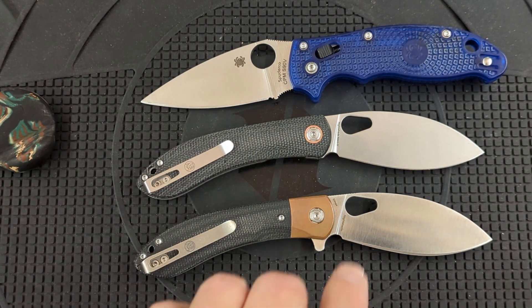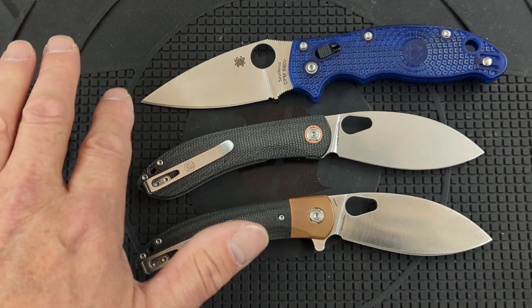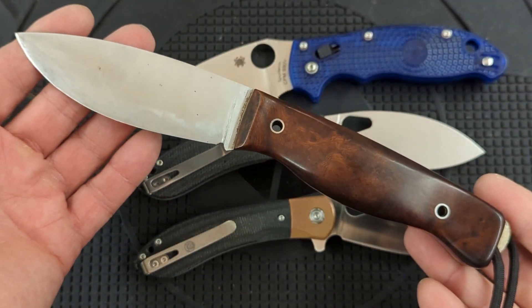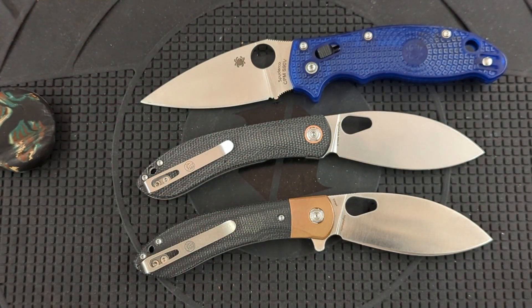These Nightshades have it, and it's even exaggerated a little bit more — a continuous curve with a little extra belly, where the Manix II is just a continuous curve without extra belly, strictly the leaf shape. The fixed blade I made is a continuous curve with a little extra belly and the dropped blade. So I think these features improve the cutting performance of a knife, along with a good steel that has a coarse carbide structure that takes and holds a toothy edge. And as the edge breaks down, more coarse carbides are exposed, having your working edge last for a very long time. These characteristics are great in an everyday carry knife you're going to use for real-world tasks. We'll see you next time.